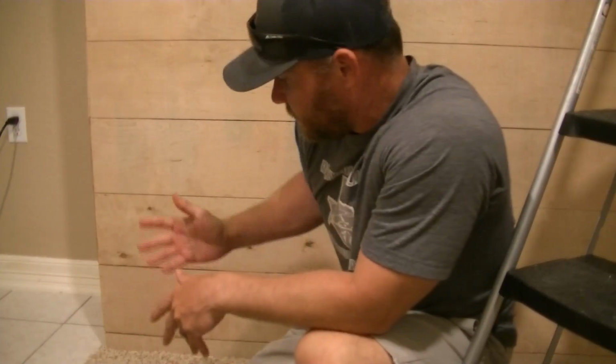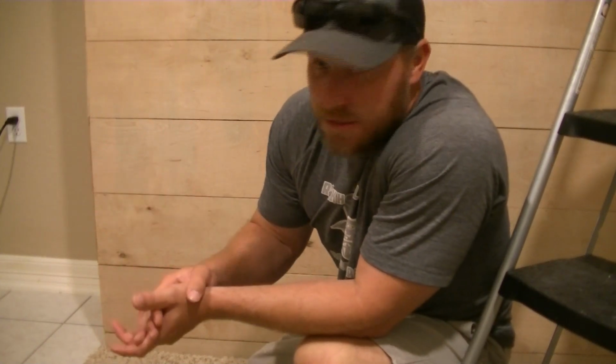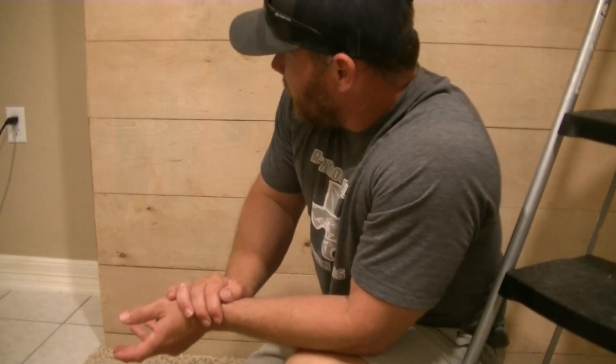And for the floors, trim wise, we're just gonna use some typical quarter round that you can find anywhere. I have some here at the house already. So I'm gonna cut it up, put it around the bottom, match the trim to come up on top of it, miter the ends there so there's not that much of a seam. And then fill whatever I want with caulk.